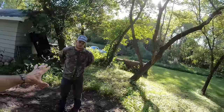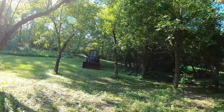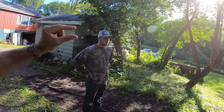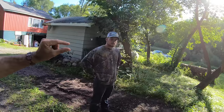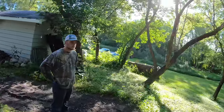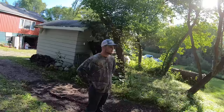One of the things we've also got to remember is every time we're adding soil over there, if there are trees — if they're oak trees — they're going to die. You can't even add this much soil on top of an oak tree. I don't want to get you started on the wrong foot. But I'm allowing it here because these are junk trees — I don't care if they die, I'm just going to burn them up one day when they fall over. So let's fire up the skid loader and get started.